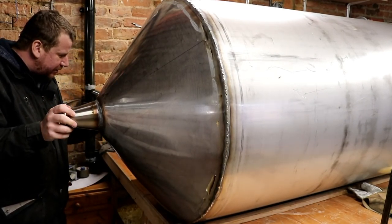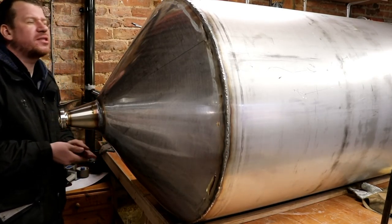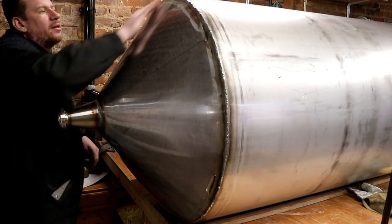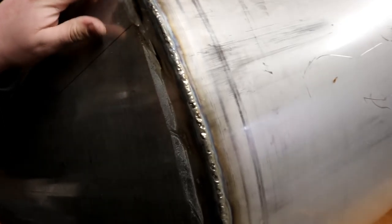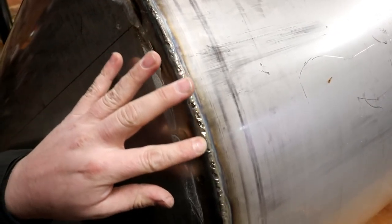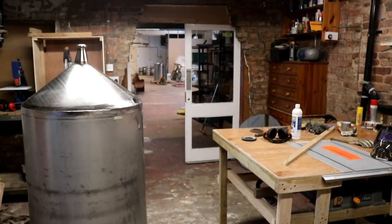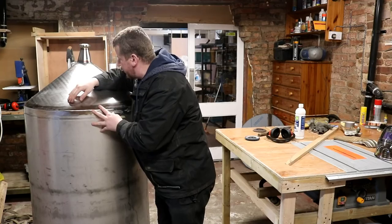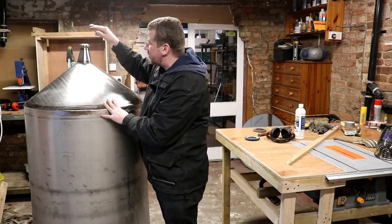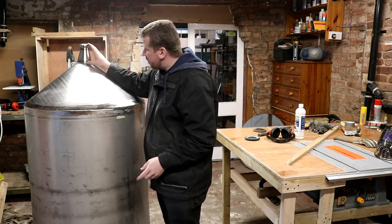We'll drop this tank down on the floor and finish the seam off with the buffer wheel and the sanding disc. The nicer welds are on the inside of course, and this has been flowed on the outside. The inside weld has reflowed certain bits but not completely all of it, so it looks a little bit like the surface of the moon - but once we've hit that with a grinder it'll be cool. That's another 45 minutes to an hour spent polishing this seam up. We've got two tanks now with cones and seams polished, and two tanks with concentric reducers on.